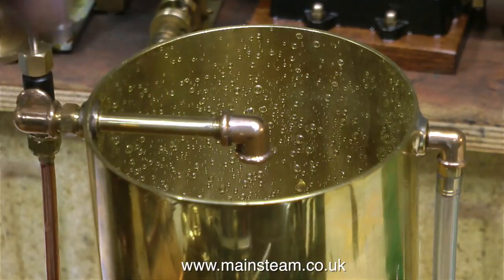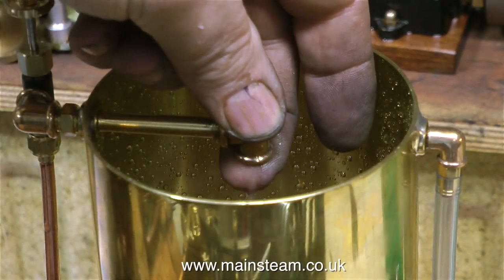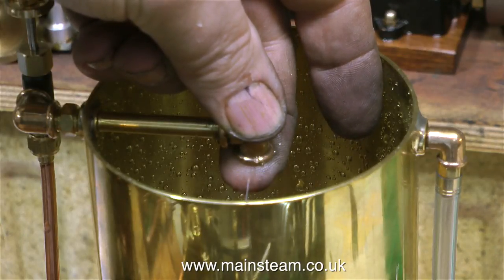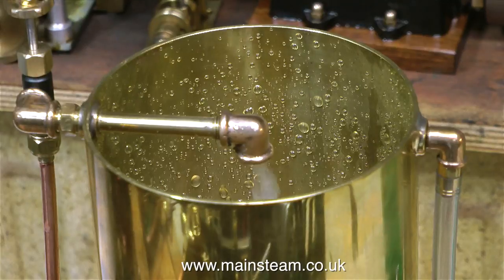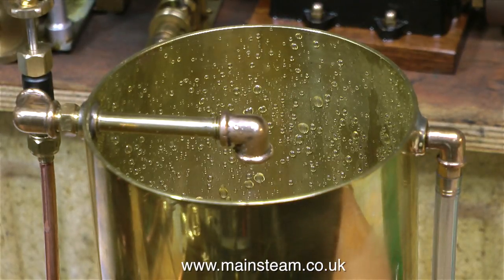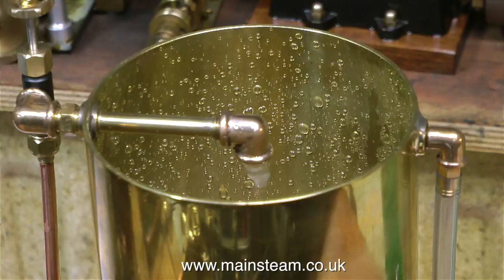When I put some air into the pump, water starts to come out of the bypass valve — and it's water that's under pressure, so the valves are working. When I try and block it up, I can't, so it will pump against boiler pressure. It's not 100%, but it's better than it was — I think there's some air getting in somewhere. Before I finish the plant, I will be going around it and making sure that all of the union nuts are fully tightened. But that's it for the moment. Thanks for watching, and I hope you found it useful.